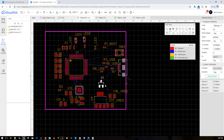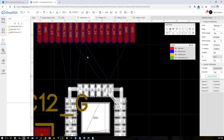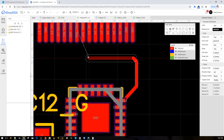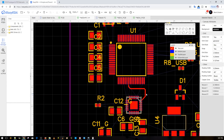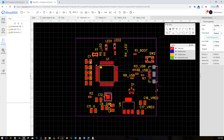There's a diode blocking the 5V from USB and the external 5V so you don't get a short circuit with two power sources going into the 3.3V regulator. The MPU6000 gyro connections are all there — gyro SDA connects right here. Routing a trace is straightforward: you just draw a wire on the correct PCB layer, similar to Photoshop. This is not the final routing, just an example to show how easy it is.